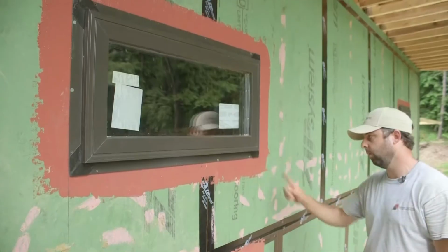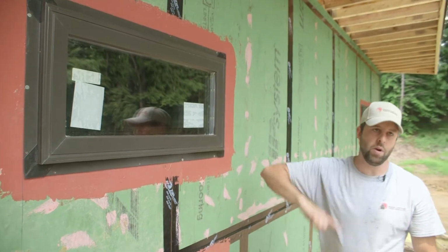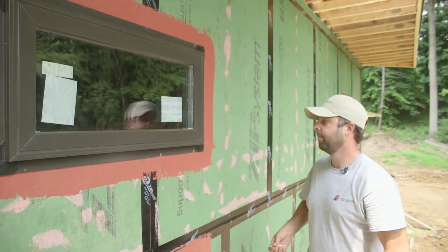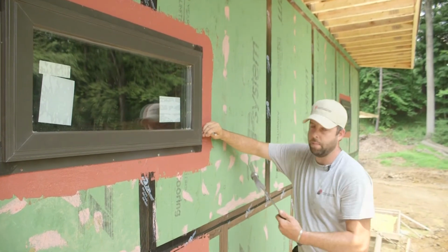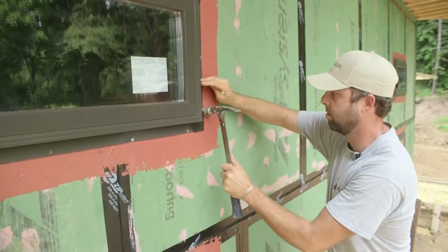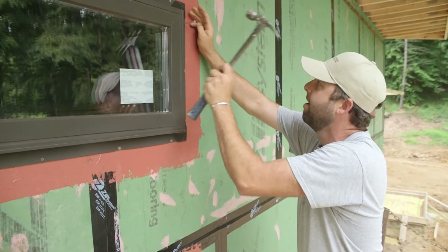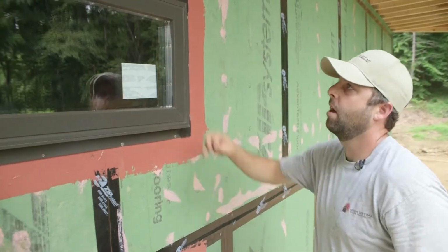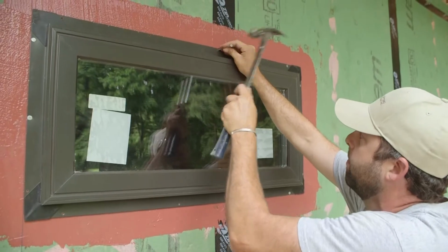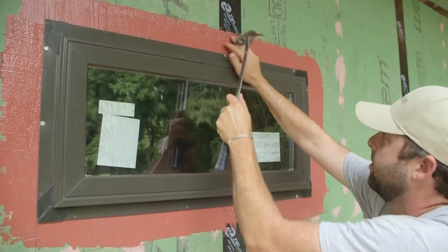But people that don't really use these products will take a normal silicone caulk, put it all over the window and put the window in, and it's not nearly as effective for air and water. People think it is, but it's not. Put a wet product on a window that someone just spent a lot of money for. Smear it all around. I'd rather install a window on a dry, cured product. That in the end is going to work better anyway.